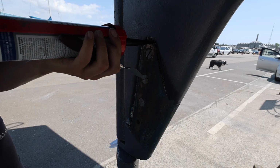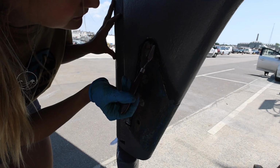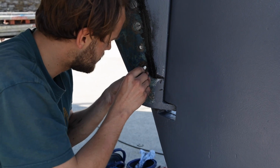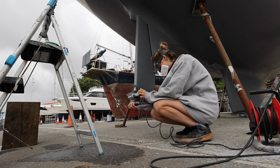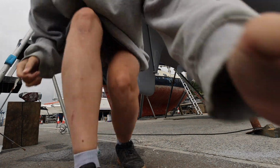While Zach was doing that bit, I had dremelled out the old sealant around the skeg plate and was re-Sikaflexing it, along with the new rudder bolt Zach spent hours looking for in a local shop, and the repair to the bottom, fully epoxied and sanded. The rudder situation should be good for a while.